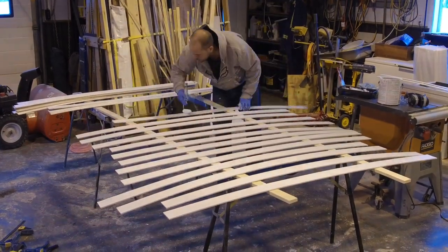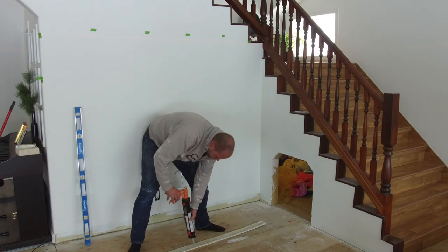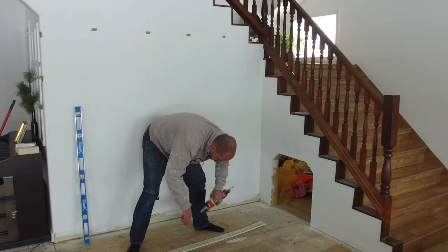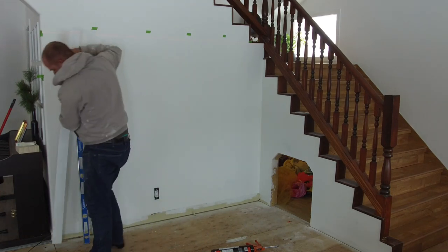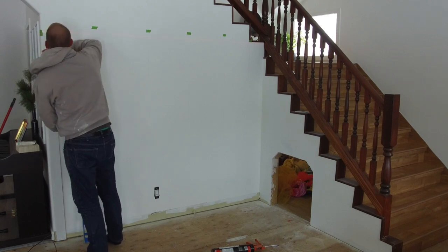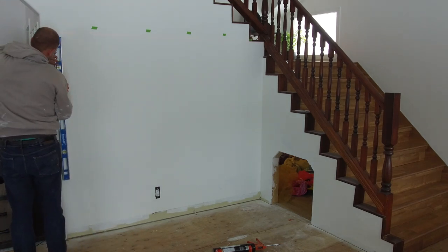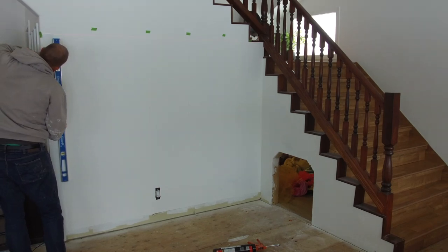When your boards are painted and ready it's time to start putting up your vertical shiplap. To put our shiplap up on the wall we first put a construction adhesive on the back of the shiplap, which I'll link to in the description below. We put the construction adhesive on the back to prevent the boards from warping or bowing on the wall. Now you're ready to put that first board up — you want to use a construction level to make sure that board is perfectly level, because if not it's going to mess with your entire vertical shiplap wall.